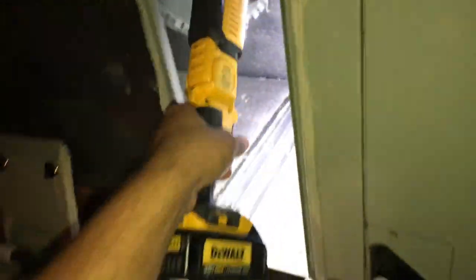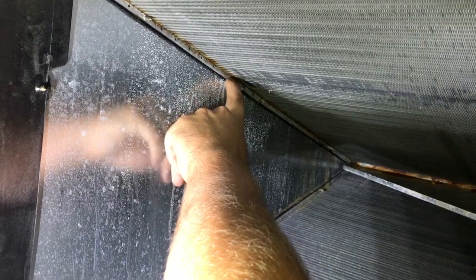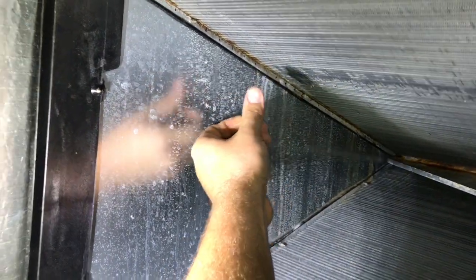So yeah, the indoor coil has already been changed once and the new one is leaking again. Luckily this has an electronic air cleaner so it's easier for me to get in here to that, but you can actually see a little bit of oil right there. Yep, I can feel it too. Just thought I'd show you that — thought that was interesting.